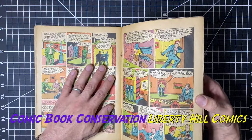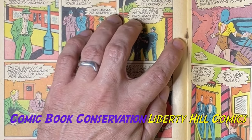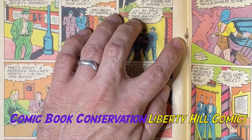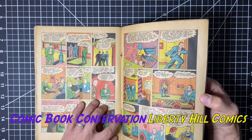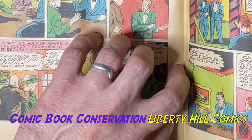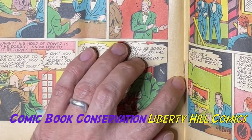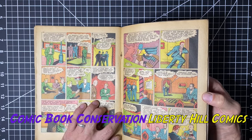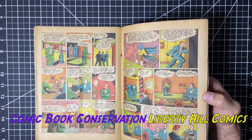Second, when you investigate these staples, see how they're meeting in the middle almost perfectly. I mean, it's actually really beautiful how the length matches and they're meeting almost exactly in the center. Both of them are like that. This one actually appears to maybe overlap a tiny bit, but they should be long enough that they penetrate the paper, come together in the center, and either overlap by a 1/32 of an inch or have a gap of about a 1/32 of an inch, okay?